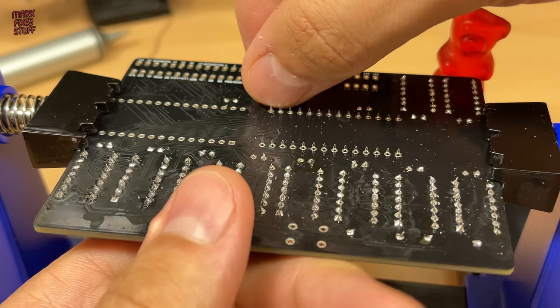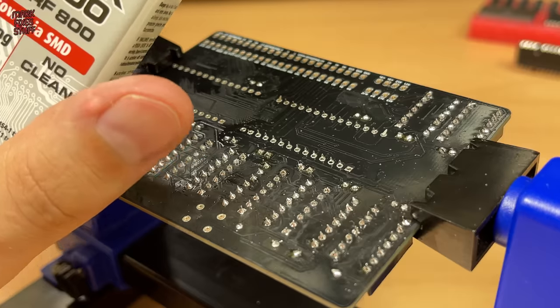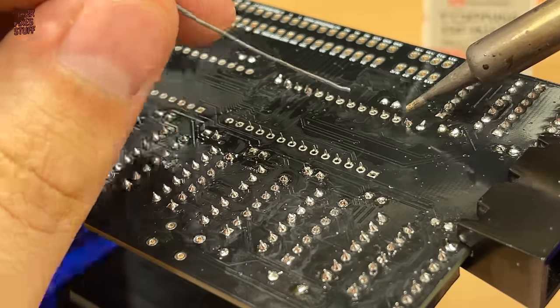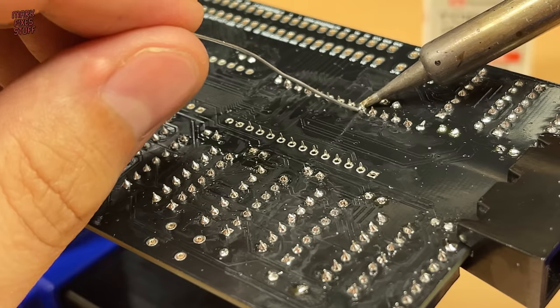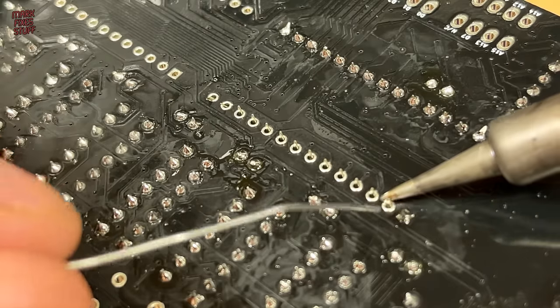into the board. This time, instead of tape or blue tack, we're going to flick the opposing corner pins on the underside of the sockets. It's not my favourite technique because the sockets can still slip and end up uneven, but it's worth showing you this alternative way of working.